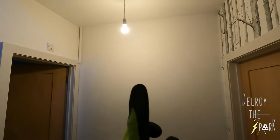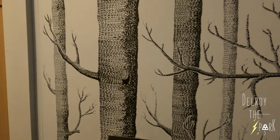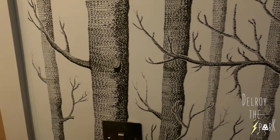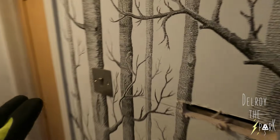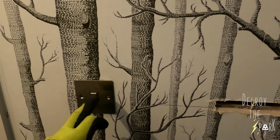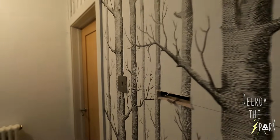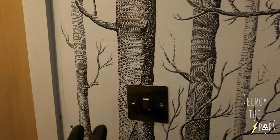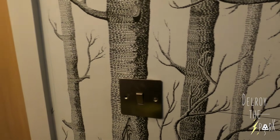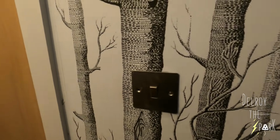The one for this light, I'm going to have two-way up there, then I'm going to have to come down here, go along here, make this one the intermediate, and then come back to here, the two-way. So you're going to have a two-way and an intermediate and a two-way, intermediate and a two-way. I was thinking of how I could have both intermediates here because of that light, switch line coming down there. But I'd have to do some connections. It's best if I just bring one straight from upstairs over to there, back to here. That's how I feel anyway.